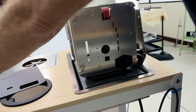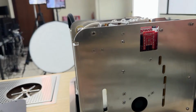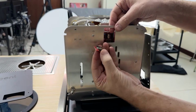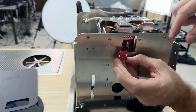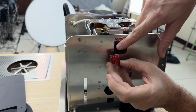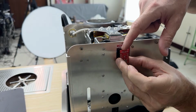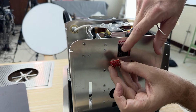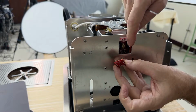Now, this little thing here, we were worried that the thing that would be the first to become obsolete is communications. This is a little Bluetooth board, following the standard that Arduino set. In fact, this is an open source design for a Bluetooth chip, and you can also buy this exact same thing with Wi-Fi on it. This here is a serial port, and this is actually running a tiny little computer, essentially an Arduino, that you can then program and put things in. Currently, all this is doing is converting the serial port to Bluetooth, but we've had other people who've converted this, for example, to another computer to have Wi-Fi, and we've got an accessory that's going to be hanging off of this in the near future, so you can use a web interface to talk to it.